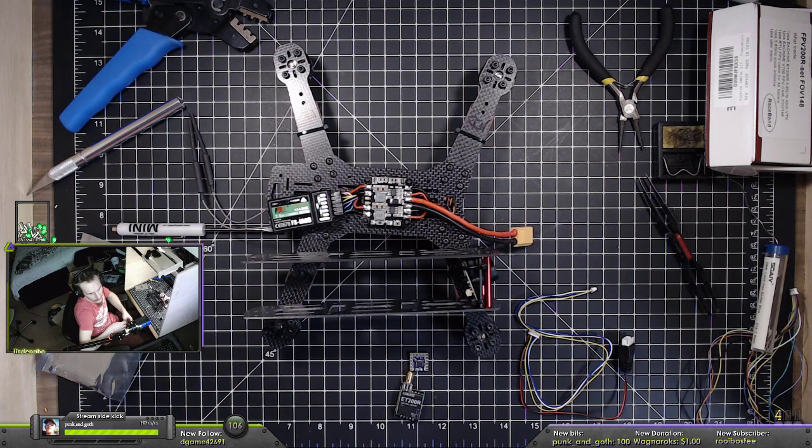I feel like the first person view may be scary with any latency. Yeah, there's really zero latency. So we're going to be running this thing at probably 460 resolution. It's going to be super low quality, because obviously if you fly with 1080, you're going to get latency. So we're actually running really crappy, really grainy. It's not the best image, but you get virtually no latency. If you want good video, then you just fly with a GoPro strapped on top.